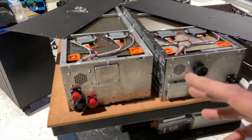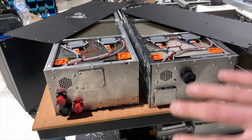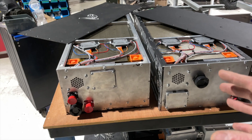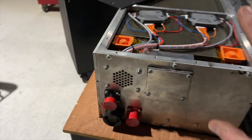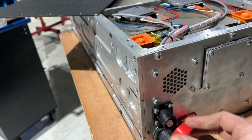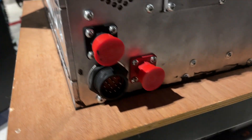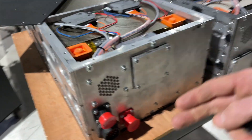Then they'll go through to final sealing — weather and waterproofing — and have a polyurethane coating over the whole box to completely seal it. On the back you can see a pressure vent that lets air in and out but doesn't let moisture through. We've also got the positive and negative connector for the battery — where all the real high-voltage electricity flows — and a 14-pin connector for all the control signals.